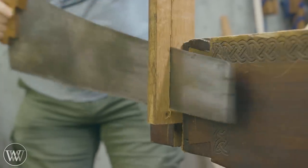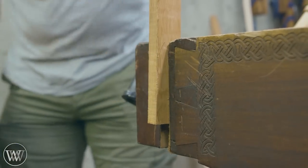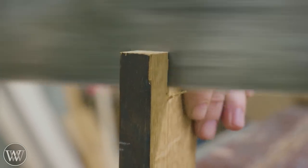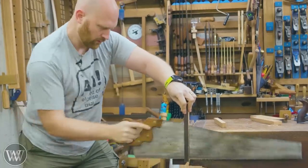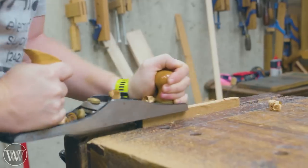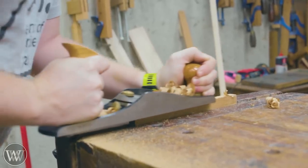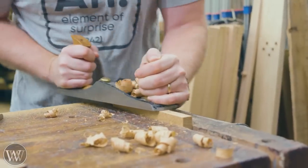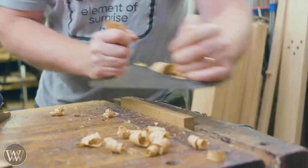In retrospect, I think this is one of the places where I should have kept them a little bit bigger, put the magnets a little bit farther apart. That would give us more friction on the face, hold the knives a little better. It would also give us a little bit more material to put the wood into, but I wanted to make them a little smaller, so we're going to experiment. And I wouldn't go much smaller than 1.5 inches, but if I did do them at somewhere around 2 inches, I think that would be just about perfect, at least for the magnets that I'm using.